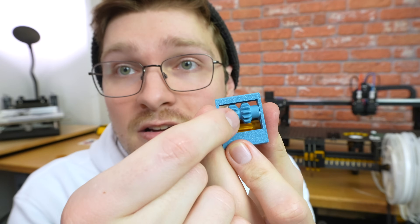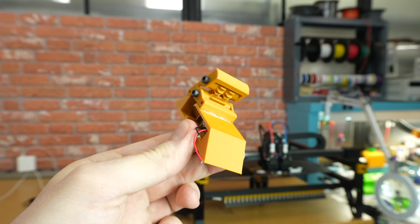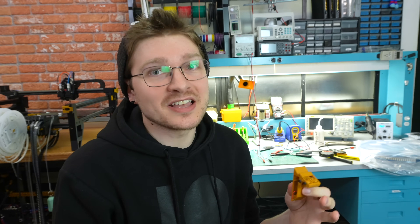I also made a little cutout on the top gear, right in the center, so that we can have a little tongue ride in that groove and pull any film out — so even if it does get a little stuck, this will guide it up and out of the way. Before investing too much more time in designing the whole feeder, I want to validate this peel mechanism first. I isolated just the backside of the wide feeder and lobbed off the rest, then glued the peel gear frame on top — just enough to gut-check if this is even remotely going to work. This trick of chopping away most of the model in the slicer means it prints quickly to test a tiny aspect without waiting for a full iteration.